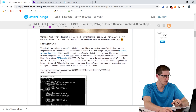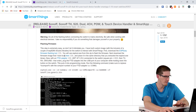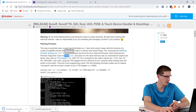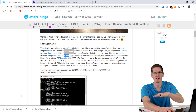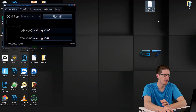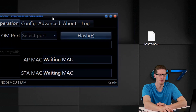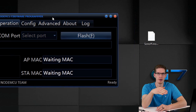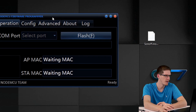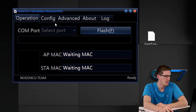I'll leave a direct link in the description for the actual firmware image. Click on it and it will download — the file is called sonoff.ino.generic.bin. That is the image we will be flashing onto the Sonoff. Move it to your desktop. You'll also need the NodeMCU Firmware Flasher — a link to that will also be in the description below.